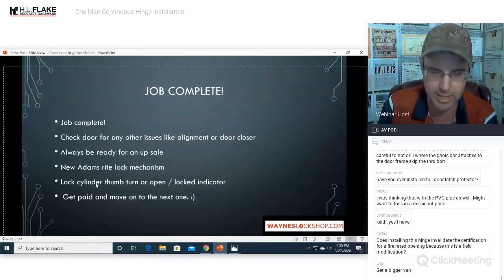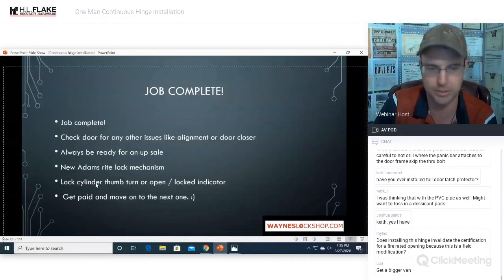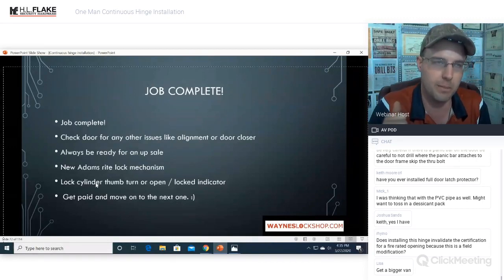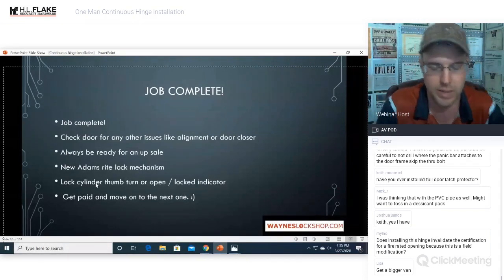Do not just say, hey, is this okay? This is my plan. No, bad times. Do not do that. Type it up, send some pictures, send it to the fire marshal, send it to the building inspector. If you have somebody who's a fire door inspector, send it to them too. Get all three of them to agree, yes, this is okay.